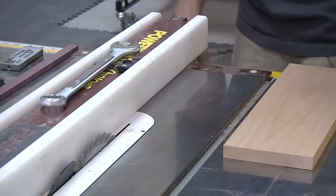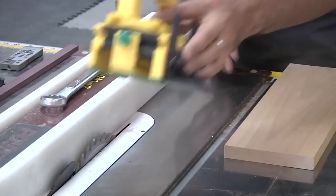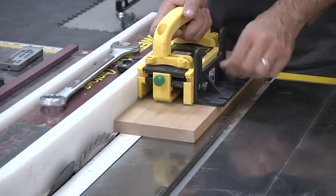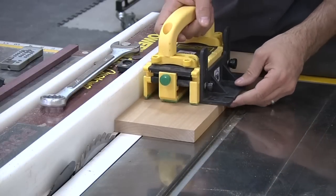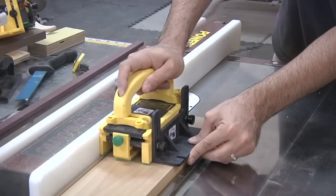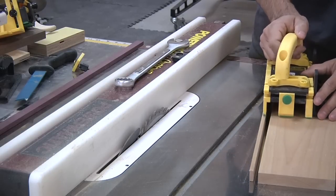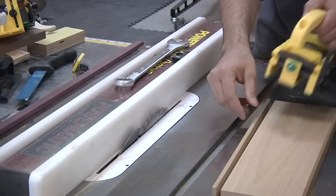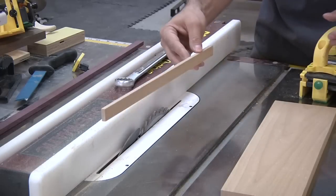So I'm going to set the fence for my quarter inch, then make sure the thin foot of the Gripper will pass through freely without contacting the blade. This work piece is wide enough where I don't have the foot hanging off the edge, so I just want to make sure the foot is nice and flat on the work piece with all the grippy feet on it and plenty of space for the blade to pass through. Not only is it safe and consistent — we can cut as many of these as we want — but the cut quality is actually improved because as we push through the blade, the pieces don't have an opportunity to wander even at the end of the cut. They stay exactly where we want them, giving a much cleaner surface at the end where you'd normally start to see ridge marks as the work piece moves.